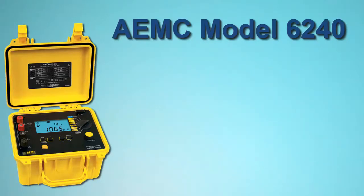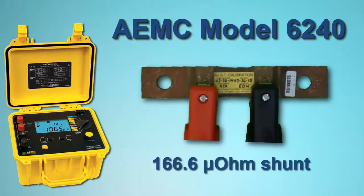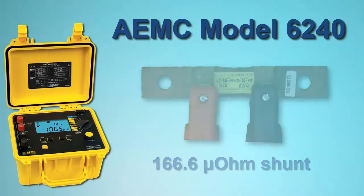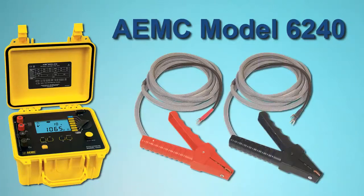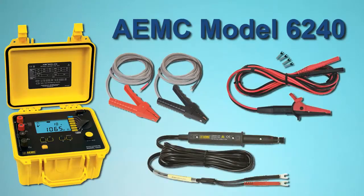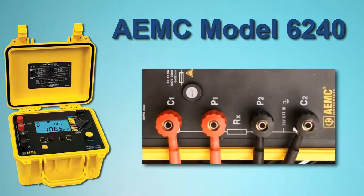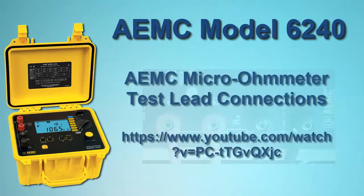For our demonstration, we will connect the instrument to a 166.6 microohm shunt and run a 1-minute test with a current of 10 amps. To make the connection, we will use Hippo-type Kelvin clips. The Model 6240 also accepts alligator and spring-tip probes. Be sure all leads are correctly attached to the instrument's terminals, as explained in a separate AEMC video.